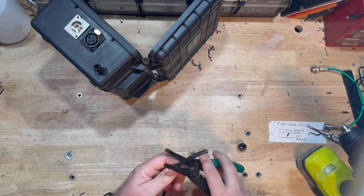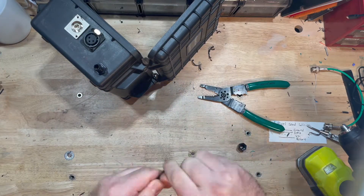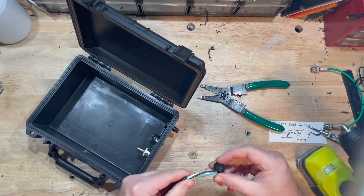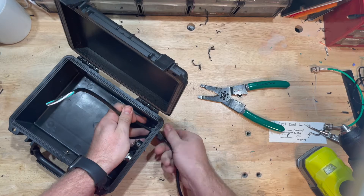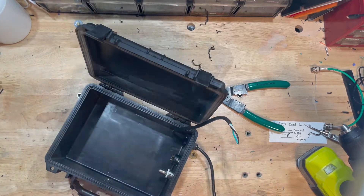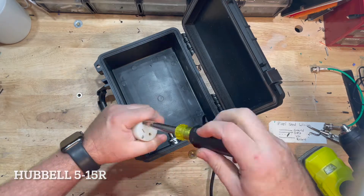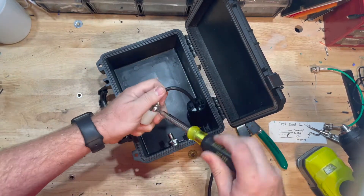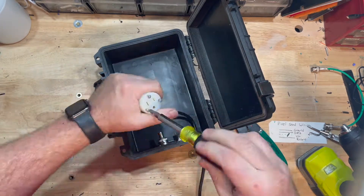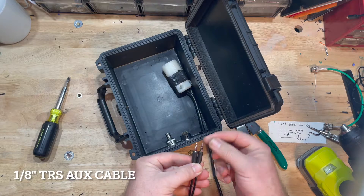Down in the bottom right I've mounted my PG-7. I'm about to take this IEC cord — I cut the end off of it, slid on the collar of the PG-7, and I'm gonna put an Edison end on it. I'm using a Hubbell 515R, which you can get at any big box store, to bring the power into the box and convert it to Edison inside the box.